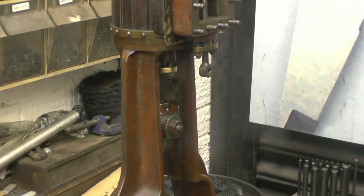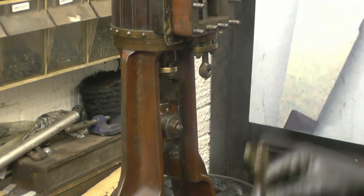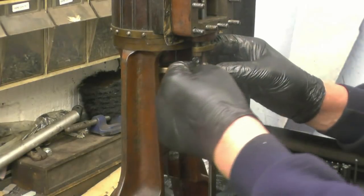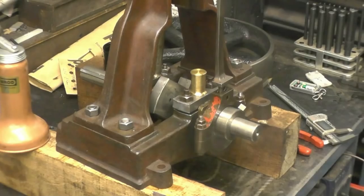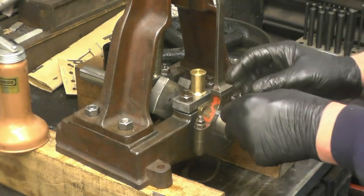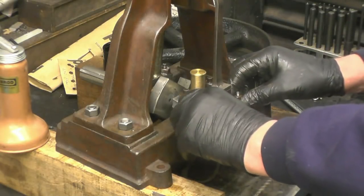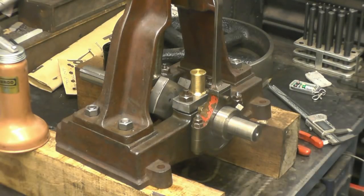There's an oil drilling through there to keep that lubricated. There's a little hole in there for a split pin — I must get some small split pins. Right, that goes in there tucked in, then we'll get the end cut off when we're finished assembling it, once we get the valve timing set, which is what we're going to do next.